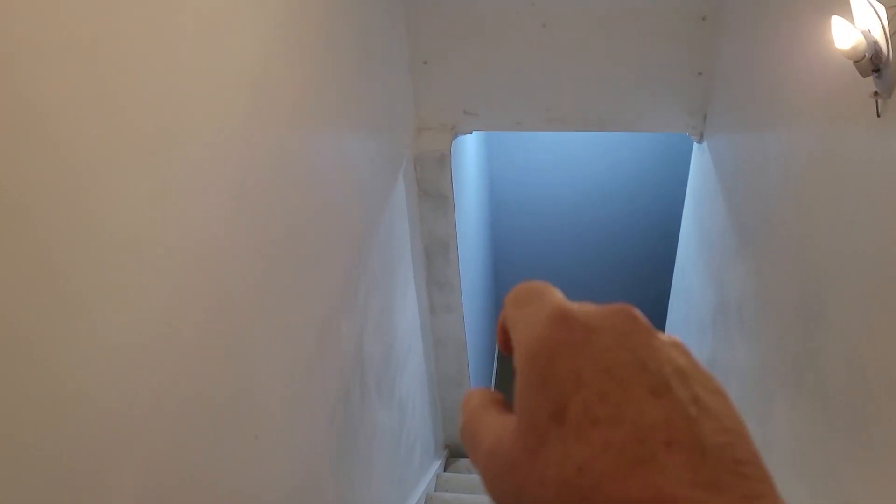The only difference is that along this edge we need to put the blue — in this case we're doing blue, that's the wall color — up against the ceiling, and we want to make sure we don't get any blue on the ceiling because that's very hard to fix since I can only reach it with a pole. So I'm going to use a pad to cut that edge in, taking my time and doing it very carefully.